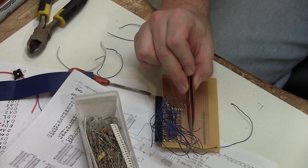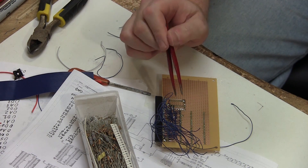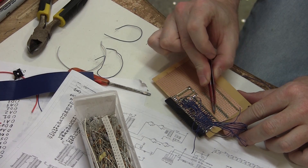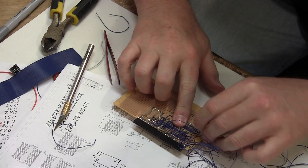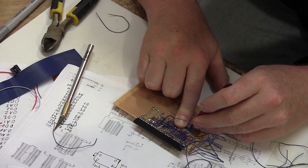Time to add the Propeller microcontroller. We need to add some resistors on one of the data buses because the Propeller runs off a different voltage than the PIA or 6502. With the resistors attached, I can now add the wires — putting the small stuff at the bottom first. I'm trying to arrange the wires as neatly as possible, bending the 8-bit bus at a right angle, just as you'd see on a real circuit board.